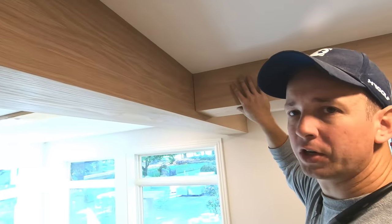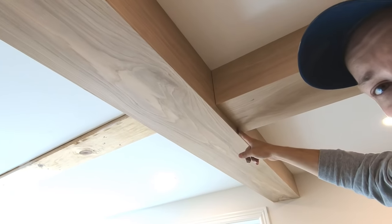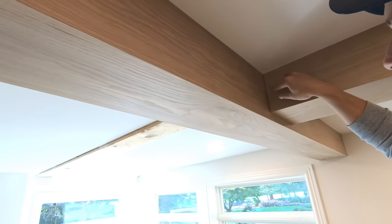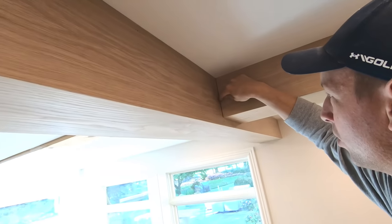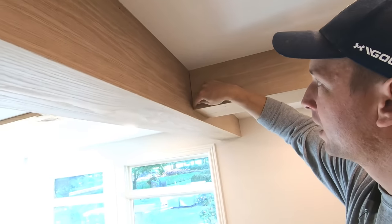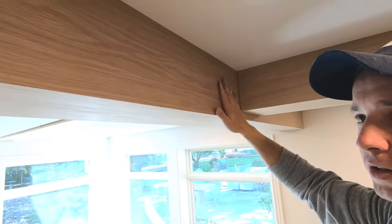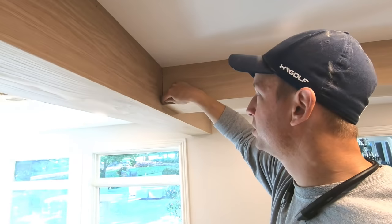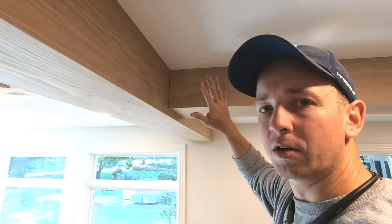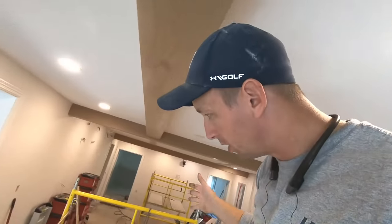Next trick I wanna show you on finishing up these beams. You can see we got our bottom pretty tight, and it may have actually pushed this beam in a little bit. This might have been tighter before, but now I got a little bit of a gap there. And with dark stain, honestly, by most people's standards, they'd probably just leave it. But you can use a stave shim to fill that, and it'll look perfect afterwards, like you actually cut everything perfect, even though you didn't.